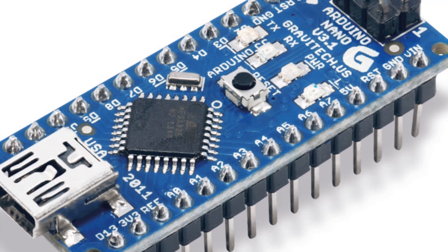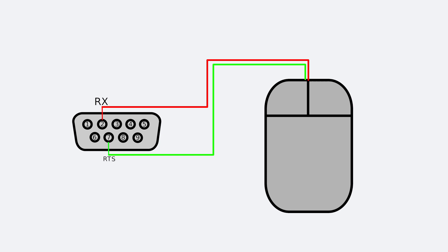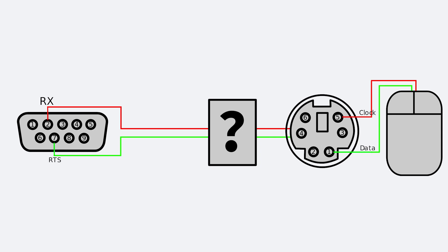There is plenty of information about serial and PS/2 mouse protocols online, so finding this information was not too complicated. At that time I was also playing around with Arduino, so I asked myself if it was possible to create a simple adapter using that. Here are some basics: the serial port on the computer communicates with the mouse using basically two pins — RTS and RX. RTS is used for notification and RX for the actual data transfer, which contains mouse position, button state, etc. A standard PS/2 mouse uses a completely incompatible protocol, transferring data using data and clock pins. Since the protocols are incompatible, if we want to connect a PS/2 mouse to a serial port we will need some instance in between to translate between the two protocols.